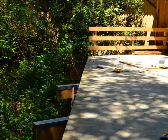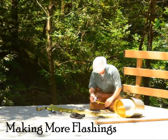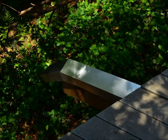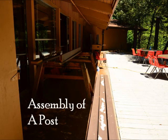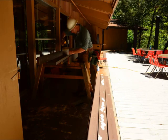We got to work from below the deck and had an idea to stiffen the posts by bracing them back against the underside of the deck. But when we had done that, we found it didn't really make the posts any stiffer. As I learned to make those flashings, I started at one end of the deck and worked to the other, and they got nice and crisp as I went along.